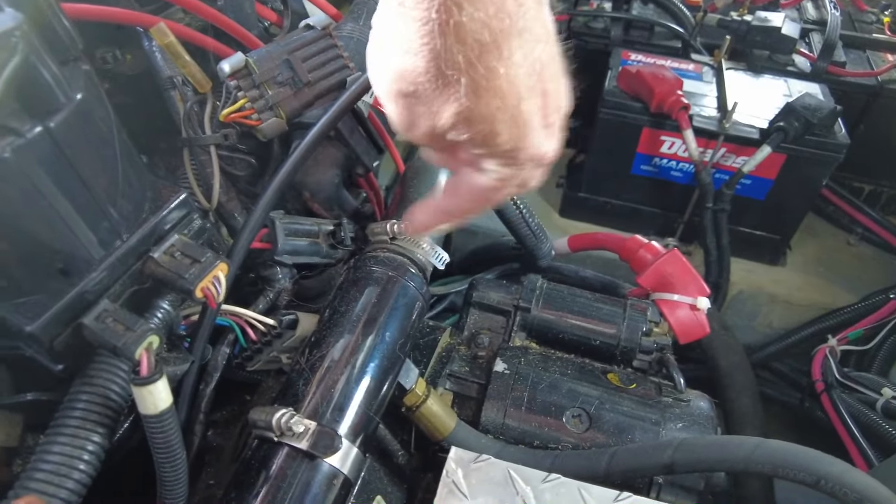Down there is the strainer for the sea water — when I say sea water, that refers to the water coming from outside the boat; in our case, it's fresh water from the lake or the river where we are. It goes through a strainer that's supposed to stop heavy stuff like seaweed or dead fish from getting into the engine. And that's a true story — last year we actually caught a dead fish in the pickup line going into the generator, which was causing it to overheat. Look for that video on my channel.